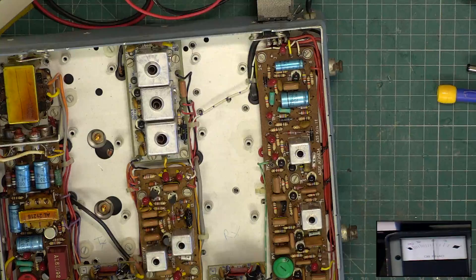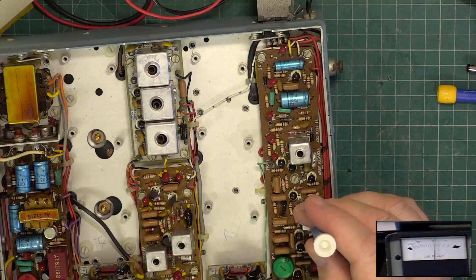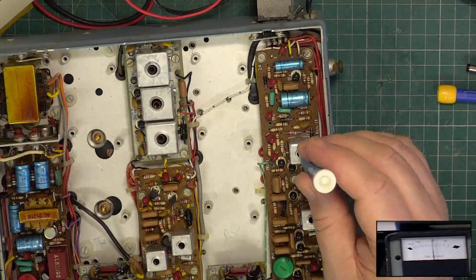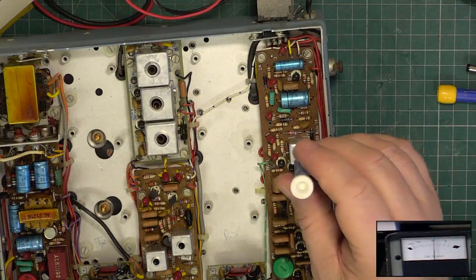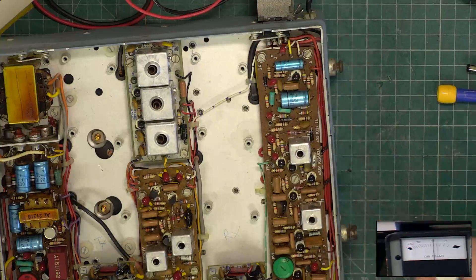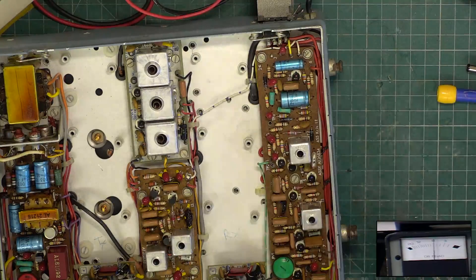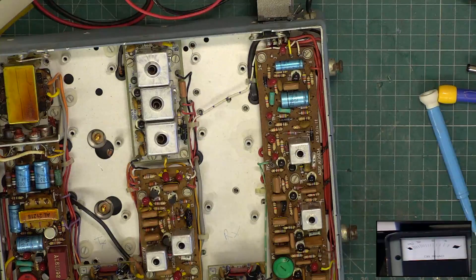Let's turn the volume up. We've got peak on that, and we've got peak on that. Now to put it on frequency - I'm going to show you this while I've got it this way up. I'm going to turn the tone off, put a bigger signal on. I've got the signal generator on 30 microvolts at the moment, so we'll drop it down to 10.